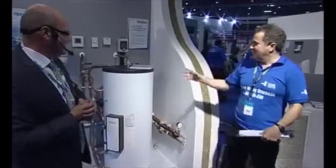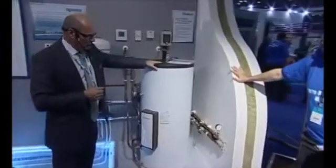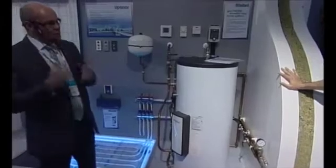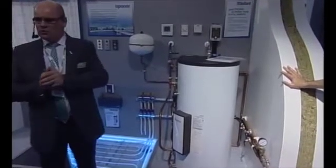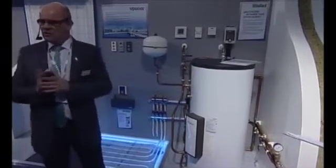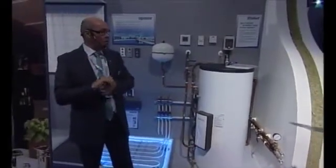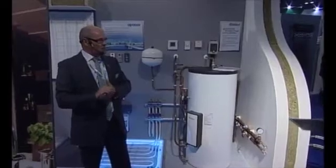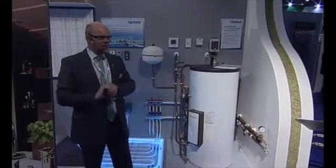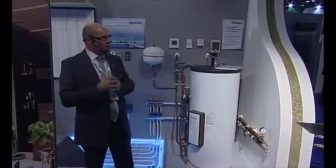This doesn't look like a standard water boiler — this is an unvented hot water cylinder, which we've coupled in. You can use these units to produce hot water, but the greater the temperature you want to draw from atmospheric temperature, the COP — i.e. the efficiency — will fall. Realistically, these are ideally suited to underfloor heating, where temperatures required are a lot lower compared to a normal radiator system. Retrofitting onto an existing system needs a lot of planning to work out radiator sizing and heat output.